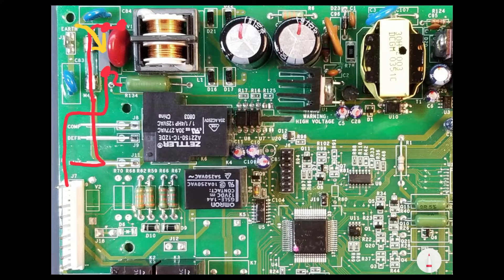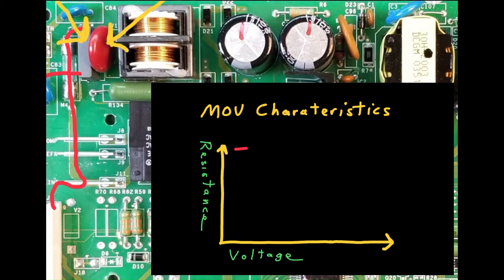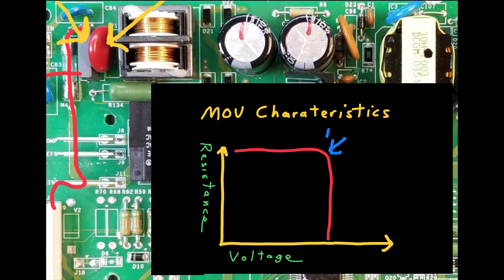Also, after passing through this surge resistor — more about this in a minute — neutral and L1 are in parallel with this MOV, or metal oxide varistor. This device has almost infinite resistance below a certain voltage, but approaches 0 ohms above a threshold, such as 400 volts, as in the case of a voltage surge caused by nearby lightning. Consequently, high current flows through the MOV, taking out the fuse.